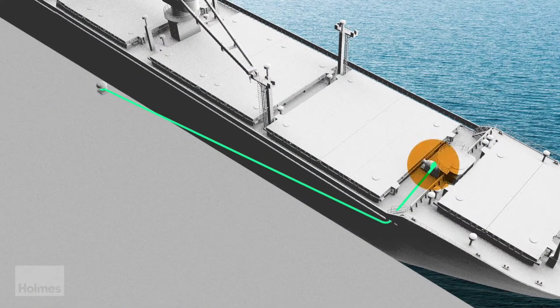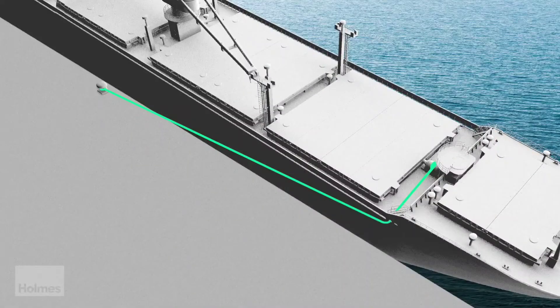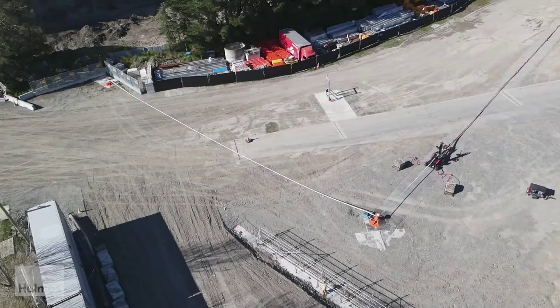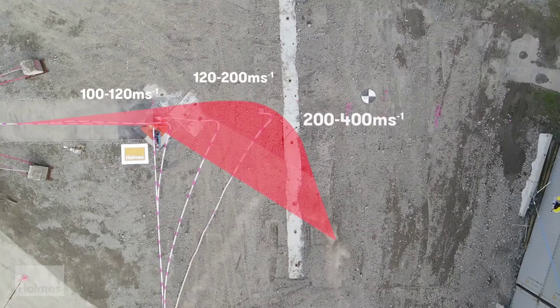The point of rupture on the line was at the capstan, located in the middle of the ship, where the line changes direction — this is the ship's fairlead, which in our case is the redirection bollard. We install the protection fence in front of the redirection bollard.